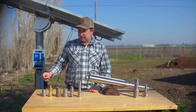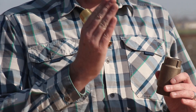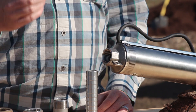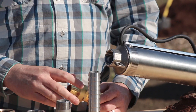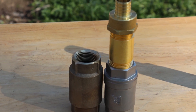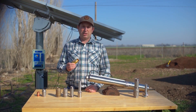If you don't have stainless steel fittings available, your next best option is brass fittings. When using brass, you want to minimize the number of transitions from stainless steel to brass. Do the one transition out of your pump and then go to whatever other brass fittings you need, with the final transition to your drop pipe. That minimizes the contact points where dissimilar metals are present and reduces increased oxidation rates.